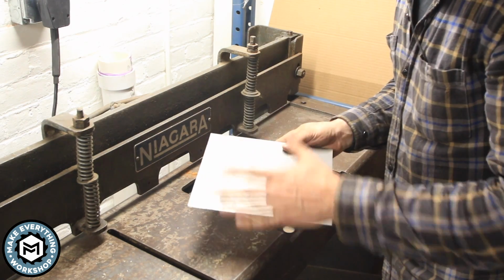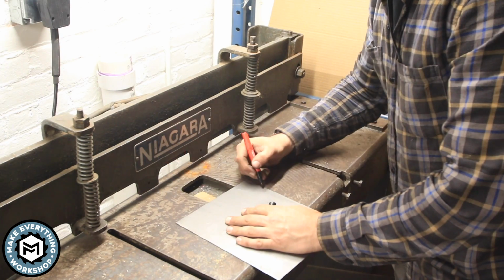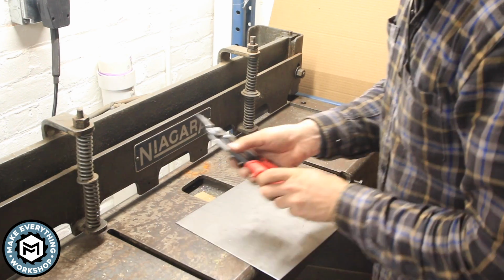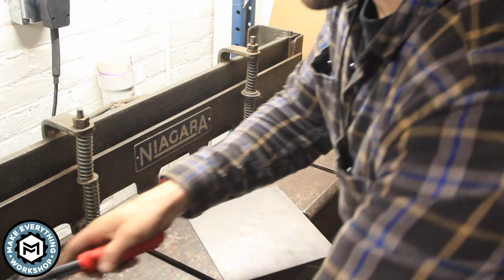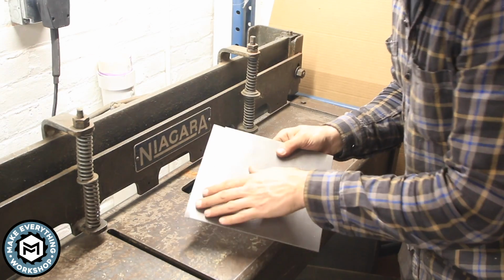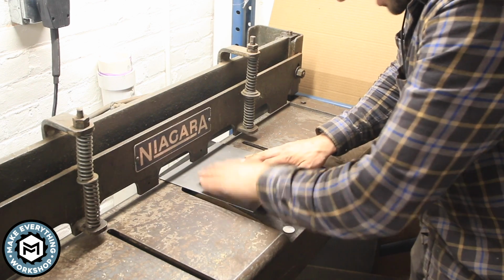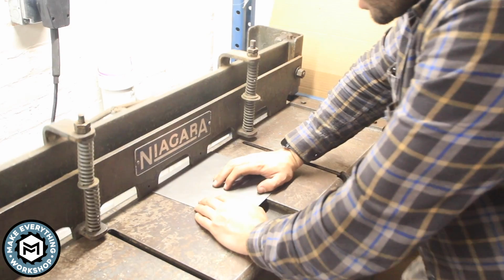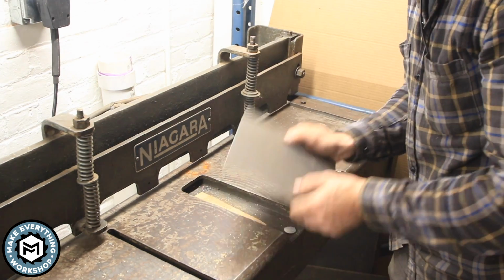And now this can work for any angle. That's the beauty of this trick. If we want to make another cut, and those are our two stop and start points, let's say we have to scribe this in, I can take my snips again, and even though I'm on this weird, totally random angle, push this into my shear, register it back, make sure I'm nice and tight. And it's exactly where my lines started. It's going to be perfect every single time.